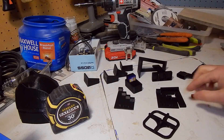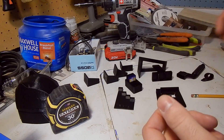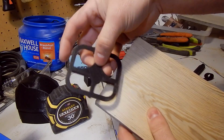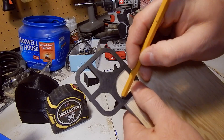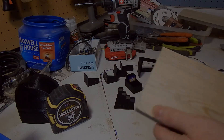The very first thing that I printed was this radius jig, which comes in handy when you're marking out corners for woodworking. The way it works is you have different radiuses on the jig — put that up on the corner of a piece of wood, grab your pencil, mark out the radius, take that to your bandsaw or jigsaw, and you're good to go.